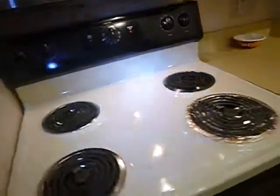This is the microwave oven. It has a vent fan in it. Vent fans are not required. Texas Real Estate Commission doesn't require that you have a vent fan. Code doesn't require that you have a vent fan. But if you do have one, we got rules. Let's say that this corner shouldn't be any farther from this burner than 24 inches. That's rule number 1.